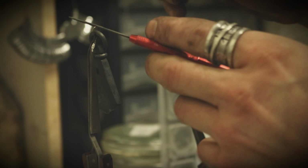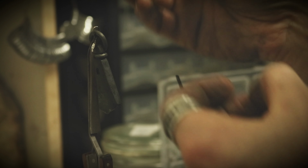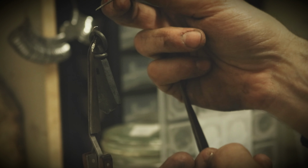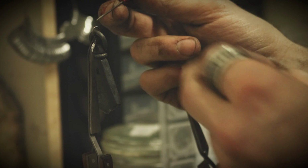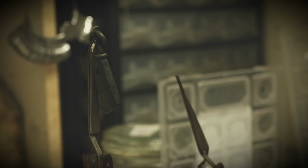Then I will pick it up with this tool here, and when heating the ring, getting it to the right temperature, I will put the solder with this tool, place it on the scarf, and then it will solder. And this is a very useful technique when making small pieces, or soldering small detailed pieces. And these are also thin material. Oh, I will need flux as well.